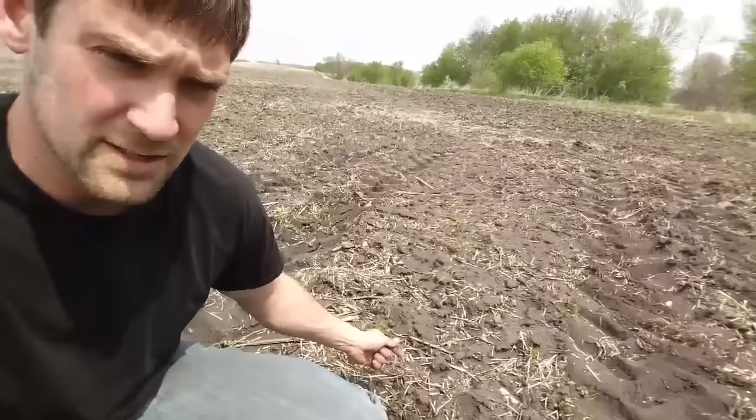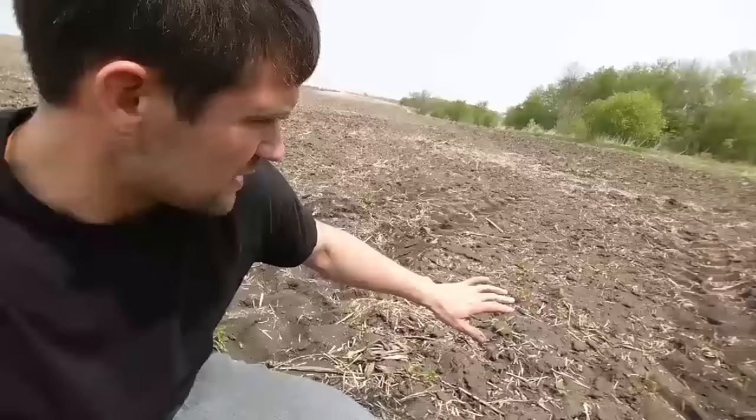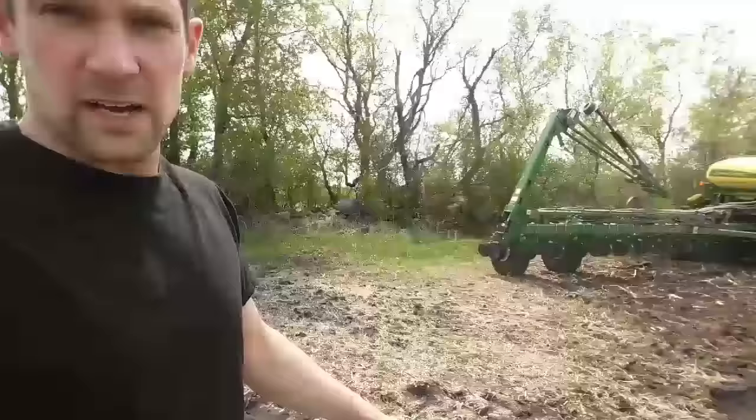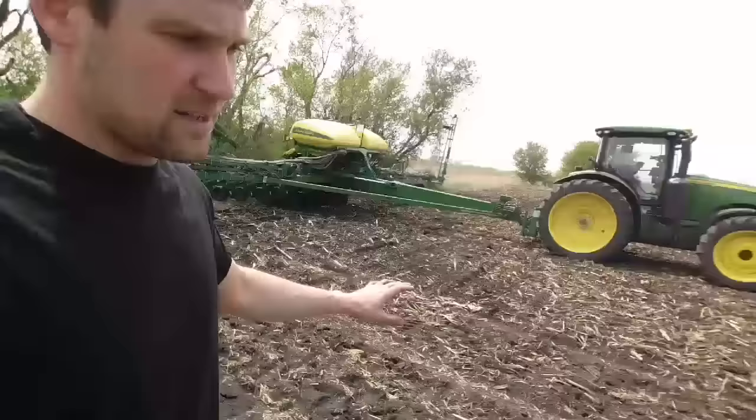This hasn't been tilled yet. We'll come in with a field cultivator — a digger, we call it — and we'll dig this soil to smooth it out. You can see you wouldn't want to come in here and plant right now because it's not a nice level seedbed, this dirt isn't as soft, there's a lot of weeds coming through. We'll come through with the digger and till it up, for the same reason you'd till your garden at home — to kill the weeds, make a nice level seedbed, and soften the soil up.